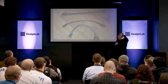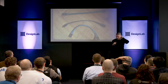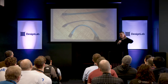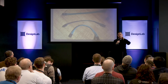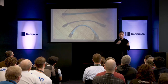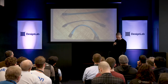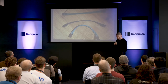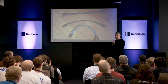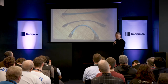Silicone is a special case — be cautious because the insulation is thicker, it breaks everyone's spreadsheets, and it does not fit in the crimps for its gauge-indicated size. So you have to make sure you have accommodation for it. Too long, didn't read: if you need something other than PVC, you probably know it. Silicone is trendy right now, but be careful about it if you have to use crimps — and you should be using crimps. We're coming to that.